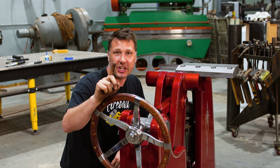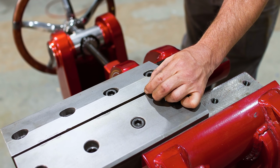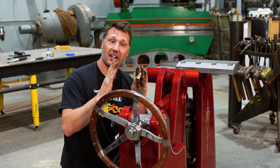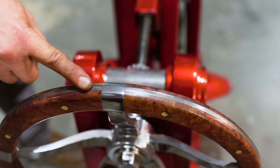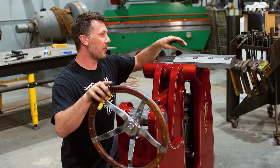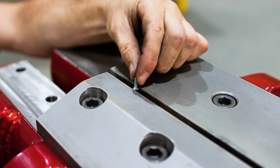There's one thing I want to share with you guys that you can't necessarily see on camera, and that's how dainty and delicate this vise really is about holding small parts. How this works is the jaw follows the screw because of gravity, so there is 0 backlash. Any little motion in the wheel turning left or right, the jaw is moving. So it's extremely handy for holding even small parts, such as screws or nuts or bolts. I can pinch right on the edge and really dial in the feel without crushing it, just by a little bit of motion, and the jaw follows my every movement.